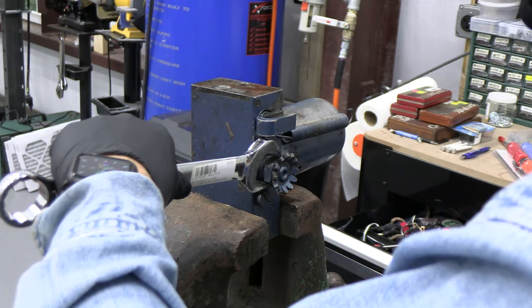We've taken again this cylinder out. This is the relief valve. It's got a single ball bearing in it. And it has two brass or copper washers. And in the kit that came for the rebuild, the washers with it are considerably thicker. So the difference is almost double.